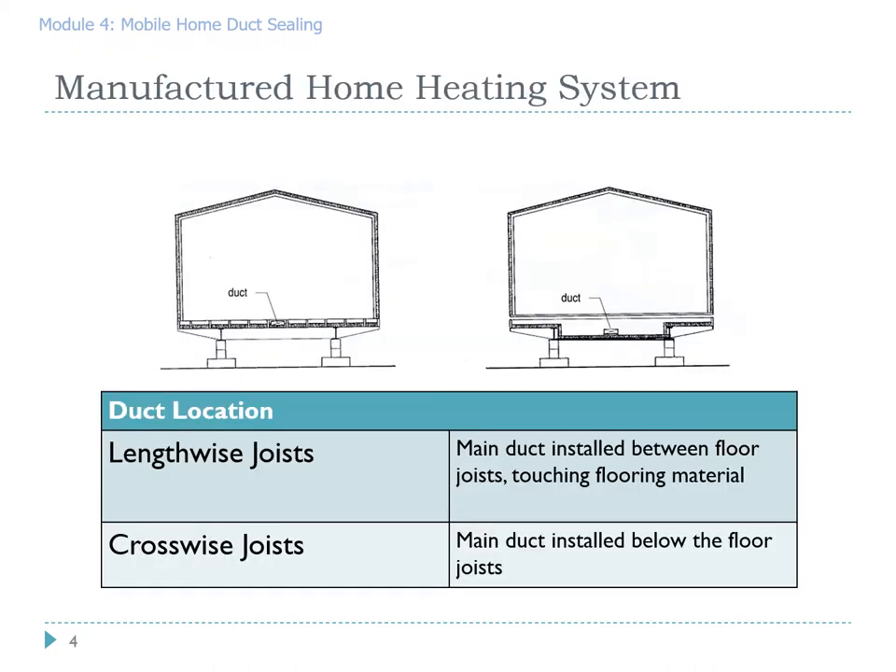Manufactured floor types come in two varieties. One is when the joists run lengthwise of the manufactured home — in that case, the ducts will be right up against the floor. Many builders build with crosswise ducts, meaning the joists run from side to side. The ducts will lie beneath the joist level, creating what is often referred to as the belly. When this is the case, there will be a transition piece from the floor to the top of the manufactured home plenum.